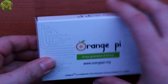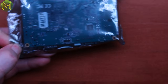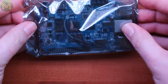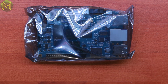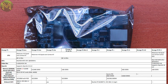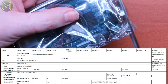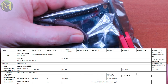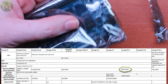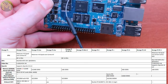Later on you'll get to see my stupidity, but for now here's the Orange Pi 2 Plus with magic smoke safely contained in the semiconductors. All of the Orange Pi models are a bit difficult to figure out, but you can check my website for a list of differences between all the models. Most of the Orange Pis are based on the Allwinner H3 quad-core Cortex-A7 running at 1.6GHz, except for the cheaper models. The Orange Pi 2 Plus and 2E have 2GB of RAM, while all the others have 1GB RAM, and the cheaper models have either 512 or 256MB.